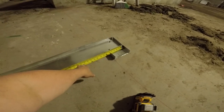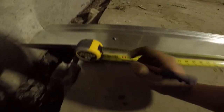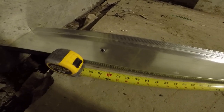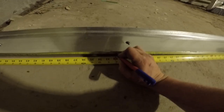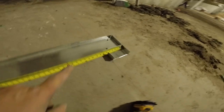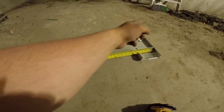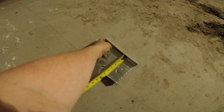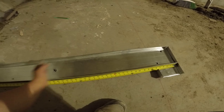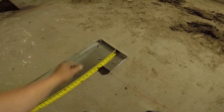When I'm doing my layout, I'm going to be coming from the inside of this track so I can make sure when I put a sheet in, it's going to land on a stud. So I come right out to 48, make sure a full sheet will land, and then it's a cut in. I mark these centers — 16, 32, 48. I go from the inside of the track out because I do the inside first when drywalling. You don't want a bevel on the outside corner, and you want to stagger your sheets from inside and outside. A bevel can land in here no problem, and then you'll lock in this floater stud when the time comes.